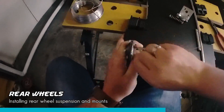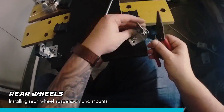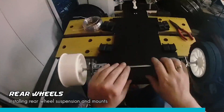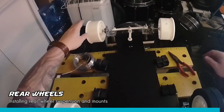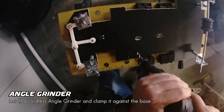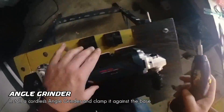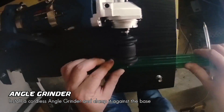Fit the horizontal wheel rod connecting the rear wheels in place. Make sure you don't have any play in unwanted directions. Do a quick test with the 3D printed rims and make sure that all four rims are equally aligned and can rotate with no extra friction. Finally, use simple clamps and tighten the grinder against the wooden base. Once mounted, measure the square you have to cut out to allow the rubber band to gain access to the rear wheel rod.